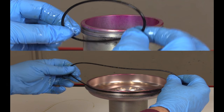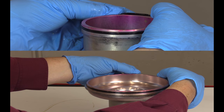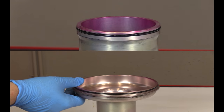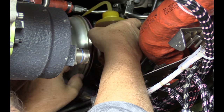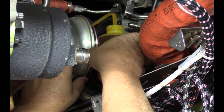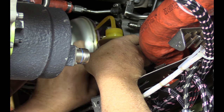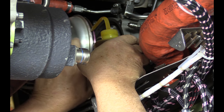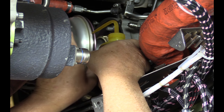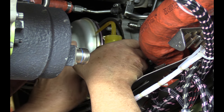The horizontal drive shaft cover preformed packings must be replaced before installation. CAUTION: Make sure that the preformed packings on the horizontal shaft cover are correctly lubricated with engine oil to prevent damage. It is easy to roll, pinch, nick, or cut the preformed packings when you move the horizontal shaft cover in and out of the AGB module.